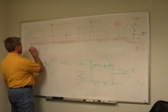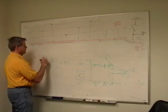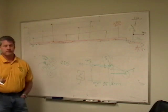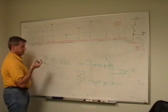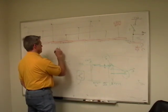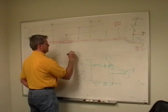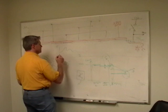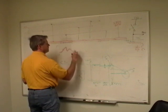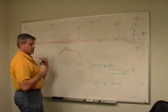And what can happen is, as your electrons transfer in, they can get trapped. These are called traps. It's an electron trap. That electron will go there and get stuck. It won't stay there forever, because eventually thermal heat will give it enough energy to pop out. So if I look at this in terms of time, electrons over time, and I say this is what I really got, what I measure is going to have some noise on it, because here one got trapped, so it comes in lower, but here the next time one of those traps released one, and so you get more and less, more and less.